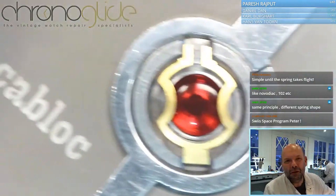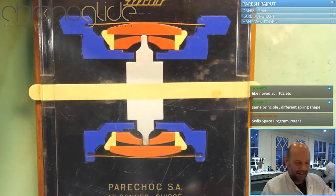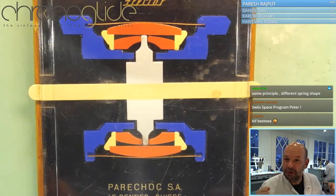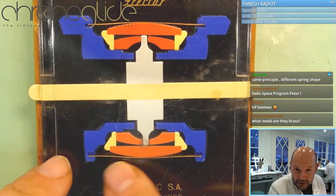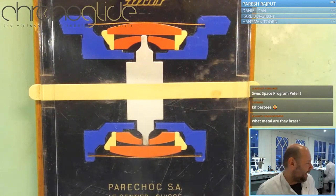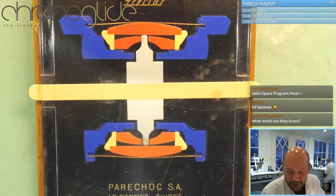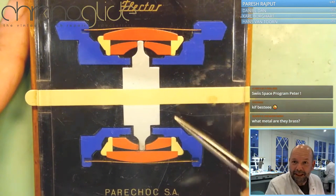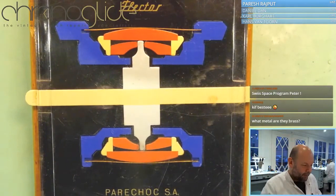Back to the drawing board. Here is the pivot — the balance staff — the big and heavy balance ring, and here the tiniest spring we just saw from the top. That's a spring, and all the red parts are ruby. If you want to know about the rubies and the jewels and how that works, there's another video on our YouTube channel. Those two springs make sure that everything is compressed, but they have some give because it's a spring. The wheel can move — during normal action there's just end shake — and if it's just moving and working on your wrist, it is like this.